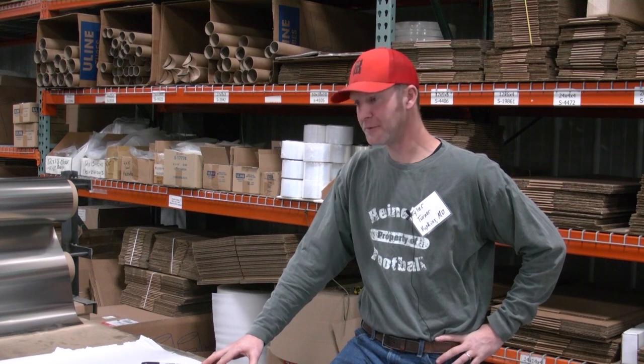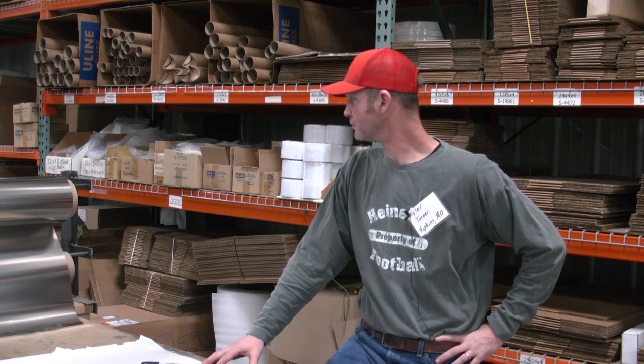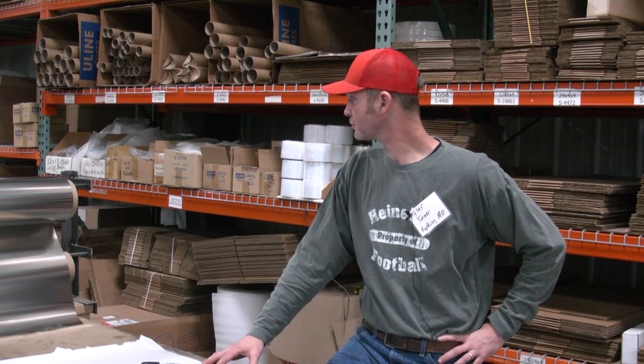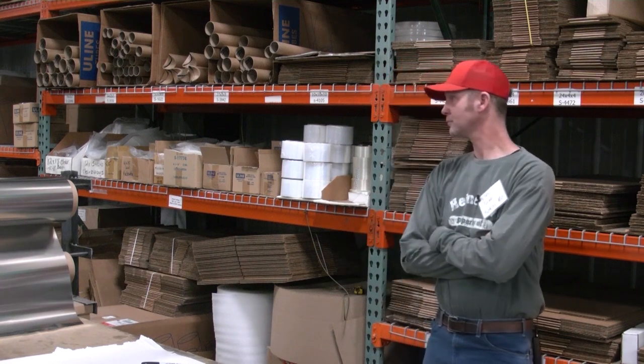Every model you make is going to be a little bit different. Every one is going to feel different. I shoot for around 55 thou, but I also kind of want three-quarters of an inch relieved, and that's just in my head. That's how I picture it. Now, if I've got a real short knife, I have to relieve along the whole length of that lock bar.